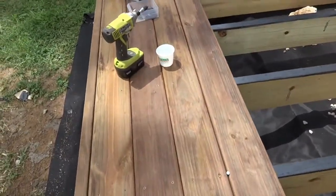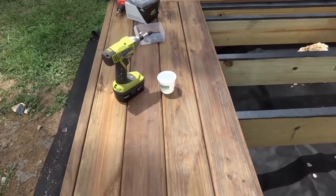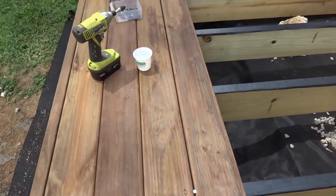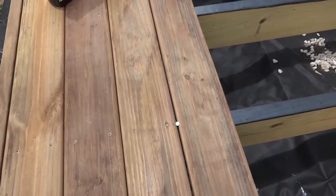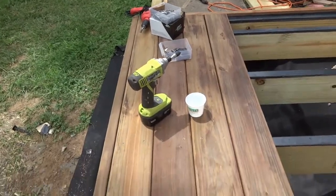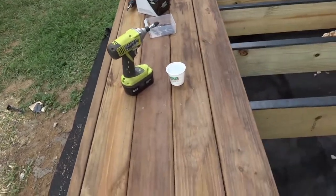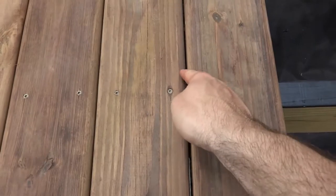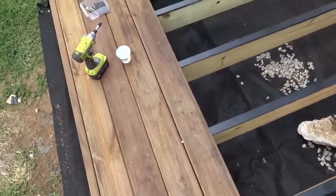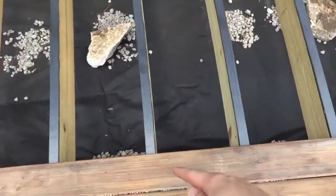My boards are kind of in between — not totally wet, not totally dry — and right now it's really hot and humid in June. So I'm erring on the side of caution and putting a little gap in them. I've been using nails as spacers: I have some little skinny interior trim nails and also roofing nails, which seem to be about the sweet spot at about an eighth inch diameter. I'm installing them in between the boards for a little bit of gap. Then I'm starting in the middle and putting in two three-inch coated decking screws, then working out from the middle.